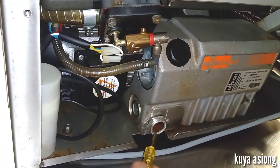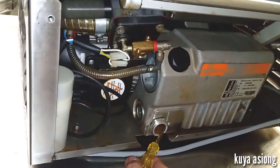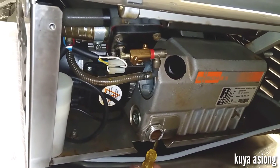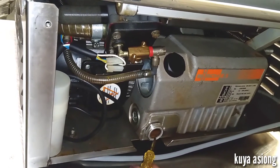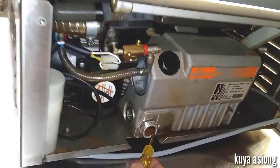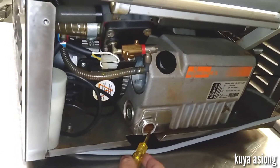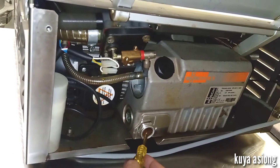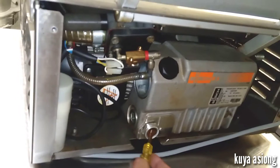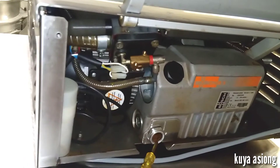This vacuum pump motor has an oil level indicator. You need to monitor and observe this properly and do proper maintenance. If the oil level is not enough, you need to refill the oil. If the oil is overheating or too dirty, you can see it here through the sight glass — you also need to change to new oil. This vacuum pump uses a special oil.